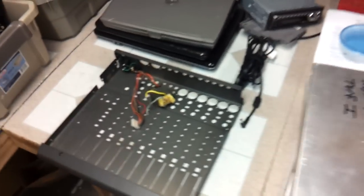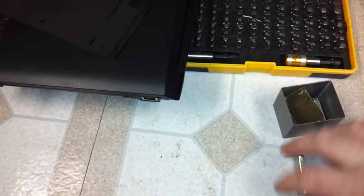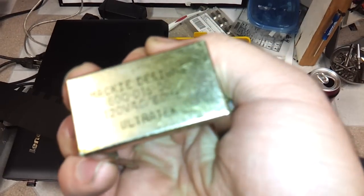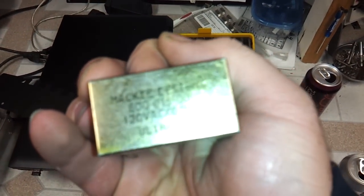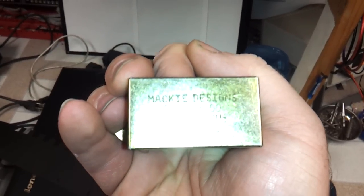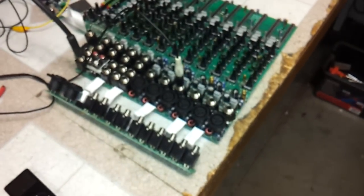So yeah, we're pretty much hosed. There's the part number of the transformer — I disassembled it to see if I could find that little thermal fuse but I can't. It's a Mackie part number 600-015-00. All it took was one capacitor to drop the rail voltage and burn the transformer out — and it didn't even blow the fuse.